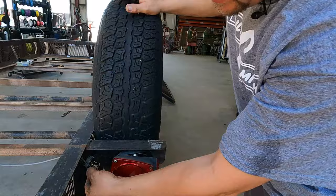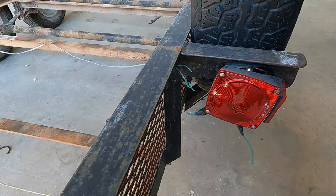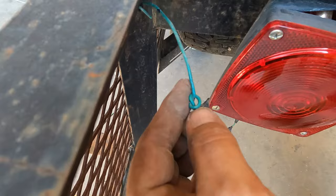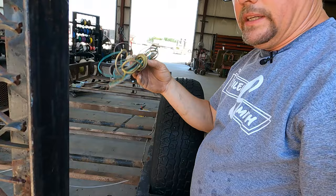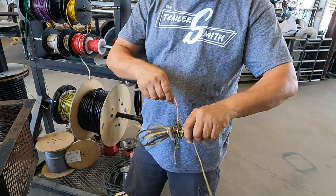Now this is using the proper clamp right here — that's the way we roll up in here. Get that specialty wire retainer off. I'm going to clip these and pull them back. That one's got a knot in it — see there? That keeps the wire from pulling through. Pretty clever. We are going to replace this section because if we don't, we're going to have a bunch of Mickey Mouse connections. We do save our wire — this is how we feed the guys on Fridays with used copper. We save it up, dump it out, get some money back. If you are going to save your copper for scrap, leave those scotch locks on there — they weigh more, get more money back.